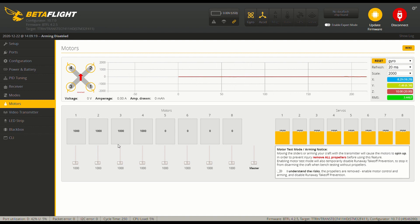Now I'm going to plug in a battery. I should hear all of the flight controller startup sounds — I noticed there were only three when I first started it up, which meant something was wrong with the ESCs, but I just wasn't paying attention. There we go — that's exactly how it should sound. No motor errors showing. I understand the risks — going to click on the motor tabs and work my way up, then back down. Motors work and that's good to go.